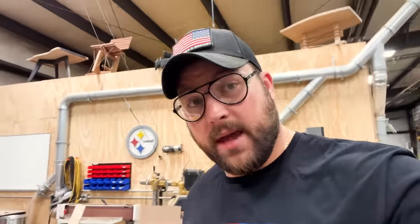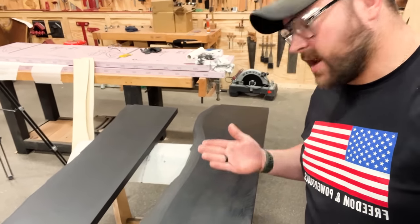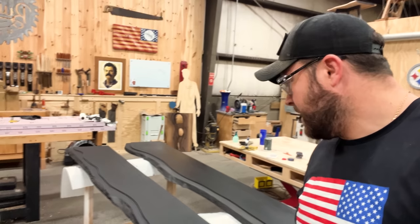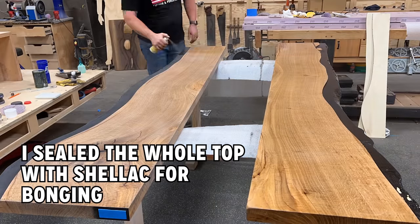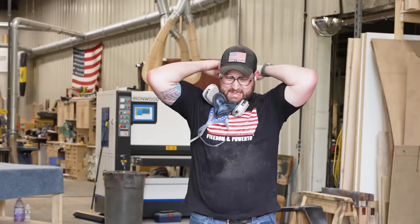It's about seven in the morning and I'm looking at the tabletop — we're still having the same sheen issues and I'm getting residue on my hands. I cannot figure out this pre-color in this short window of time, and we've got two days before we have to get this to the client. So we're going to pivot — I'm going to sand the thing completely down to bare wood and come in with a tinted lacquer, something that I know how to do and have gotten great results with in the past. Then I'll buff that down to a matching finish. I'm really concerned about the live edge and getting that color off, because lacquer will not bond to the oils from the Rubio finish. This is my last opportunity to fix it — everything's prepped and ready to go. Let us spray.